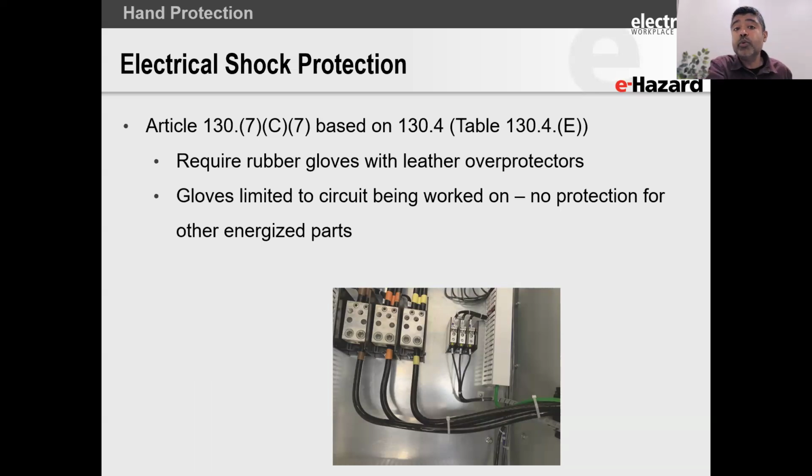then what did you do as a qualified employee? What did you do as an employer? What did you do as the person that was training the person that was injured? Those are the questions they would ask. Just as an aside, because we don't talk about this stuff often enough: if you are working on that small power block on the right-hand side, that's 208 volts, and you're exposed to the 480 volts, just saying to the electrician, hey, dude, don't touch that stuff, it's not going to end well if you do touch it, is not adequate for safety.